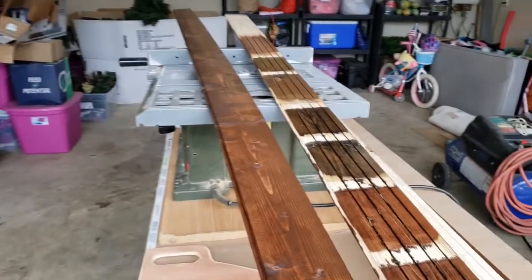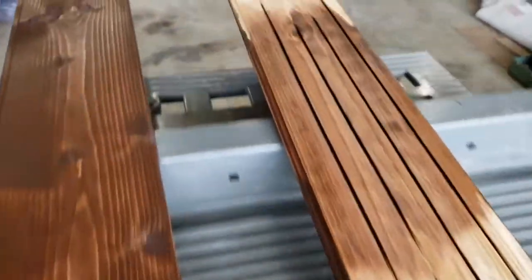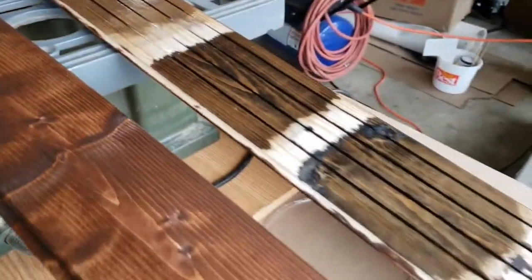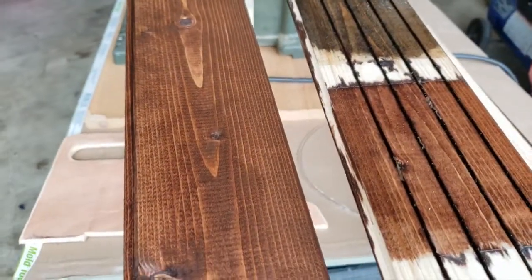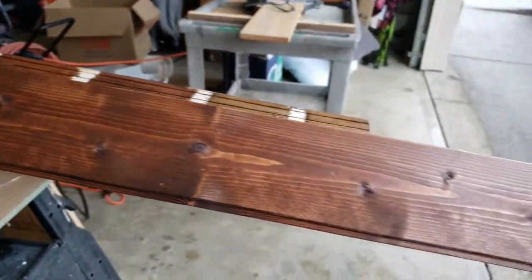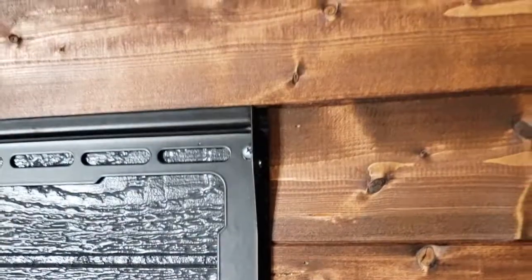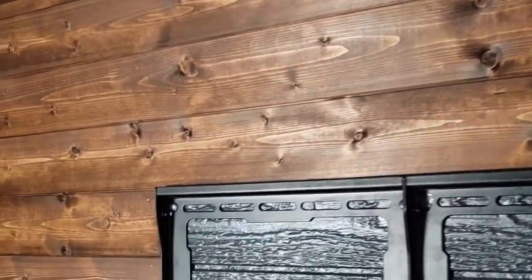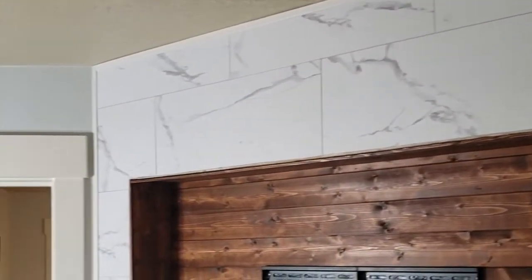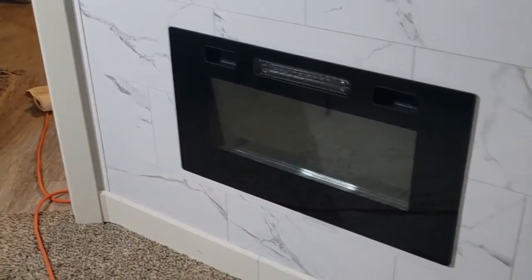And these were the samples that we went with. I think we had 6 different colors that we chose from. And she ended up going with the red oak, which is that one here. So we got them all stained up. I don't have the finish on it. I think I'm going shellac as opposed to polyurethane. But I'm real happy with the pine stained with red oak. Put 2 coats on it. And it looks really nice. I like it. Trimmed it out with some RV trim that I painted white. Reused her base. And I got to caulk up and sand her splice there.